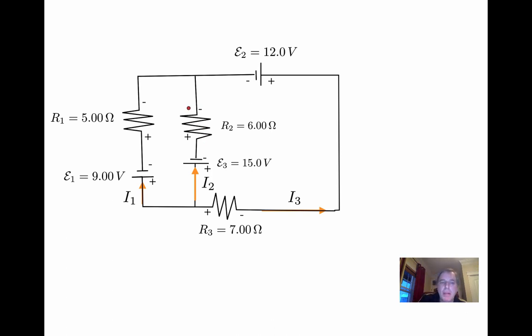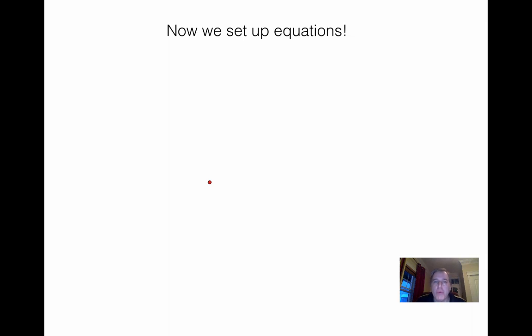Okay. So I've assigned polarities to everything. For the batteries, the polarities are fixed by the way they're drawn. For the resistors, the polarities are fixed by the choices of currents we had chosen in the previous steps. Okay, now that we've assigned polarities everywhere and currents, we're ready to actually solve the circuit. So the next step is that we have to set up equations. What are our unknowns? I1, I2, I3. So we have three unknowns. We're going to need to set up three equations for three unknowns, and then we'll solve. Okay, and we'll do that in the next video.